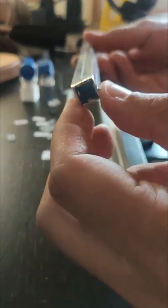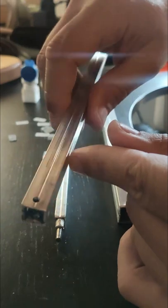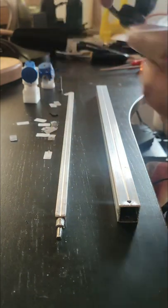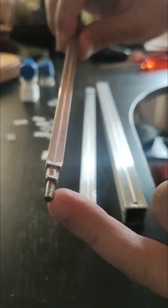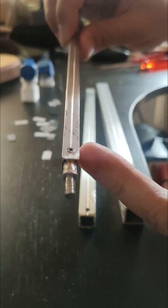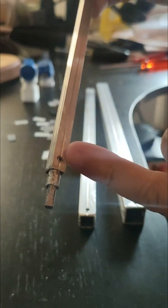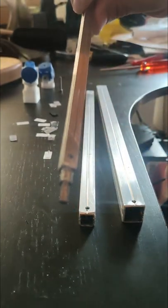This is your intermediate segment. You've got four holes on both ends. There's a little plastic pad here because I disassembled this and I'm going to reassemble it. Then you have the smallest, the inner segment, where you have a 4mm round pin coming out the tip. There's a 6mm outer diameter, 4mm inner diameter aluminum tube acting as a sleeve to fit into the 7mm outer diameter square aluminum tube outside. I've locked the pins in with a small M3 set screw that I then filed flat to be flush with the top.